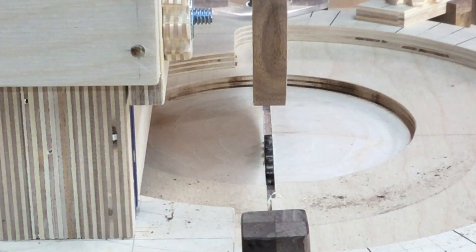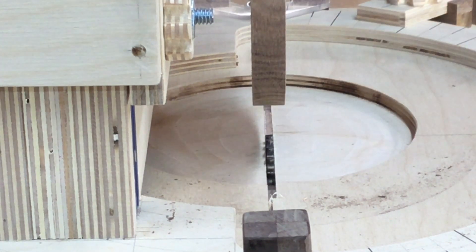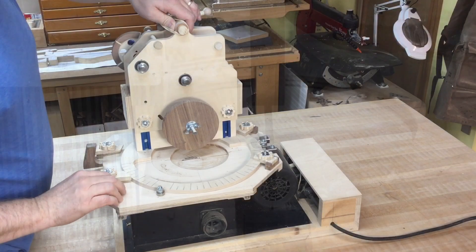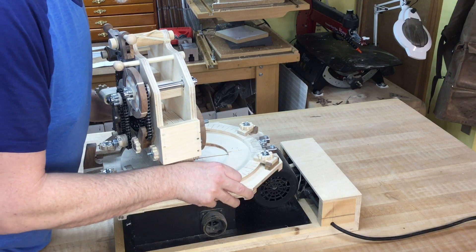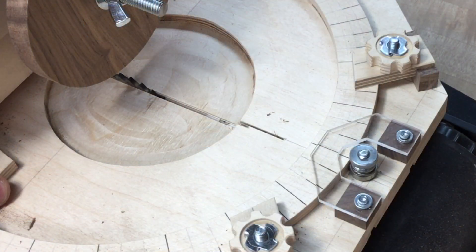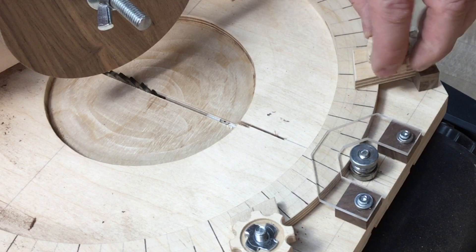You can see here from this enlargement that it is a little bit off, so I have to adjust the position of the nuts and bolts on the threaded rod just to center that wood disc securely over the saw blade. I next set the angle of the tread grooves — I've decided on this wheel that I want to use a 20-degree angle for the slant of those grooves. Each marking on the wheel is 5 degrees, so I'll set that to 20.